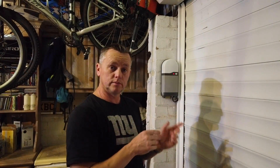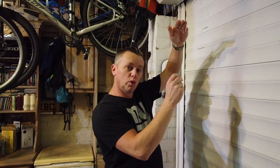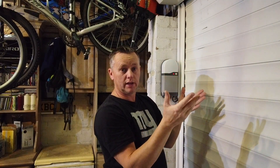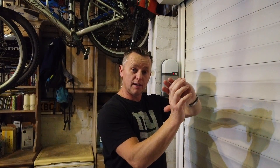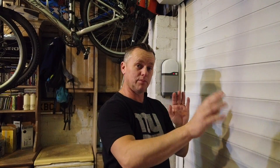The main reason I've overridden the door photo cells on my two doors is that there is a thermal cutoff in the motor. If the door jams or gets on something on its way down, the thermal cutoff will trip it and it won't continue - it can't crush you, it's not that strong. It'll just come down and stop; the thermal cutout will kick in and click back in once the motor's cooled down. The other reason is that on the outside door in the carport it gets a lot of damp. Here in the UK we get damp in winter - the reflector gets covered in moisture and the signal gets deflected and doesn't come back to the photo cell. The amount of times you pull up to the door, go to close it and it won't close - you have to get out, wipe it, and then it works. So it's disabled on that.